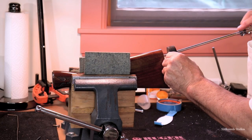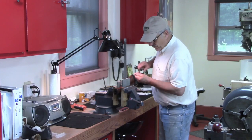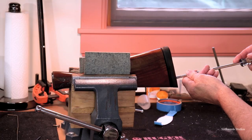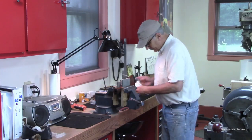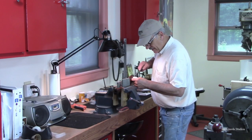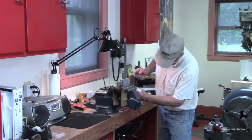We've given this a few minutes to dry, and we'll put this pad back on. And the last thing that we need to do at the end is balance the reveal of the plastic over the wood so that we've got this positioned back where it was when we did the sanding or the final finishing. Now, I've left this pad over the wood probably about 2 or 3 thousandths, and in my experience,